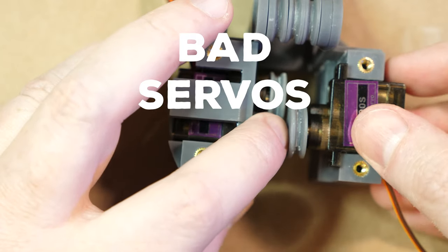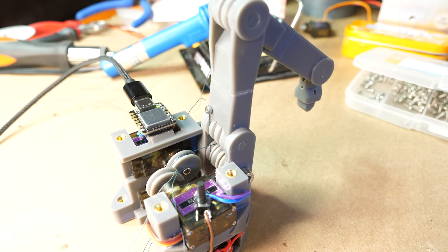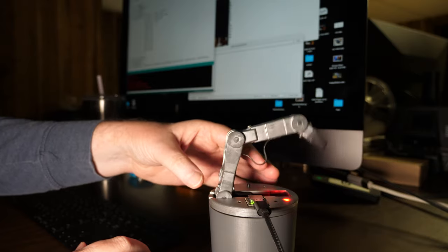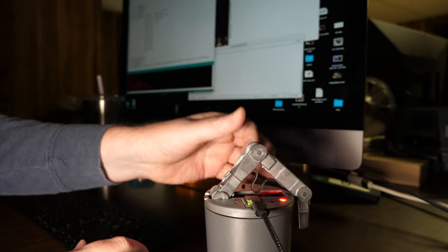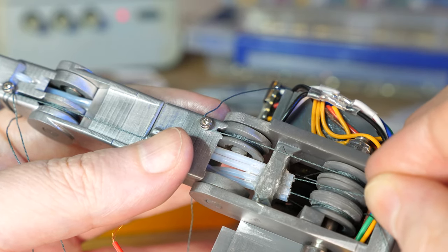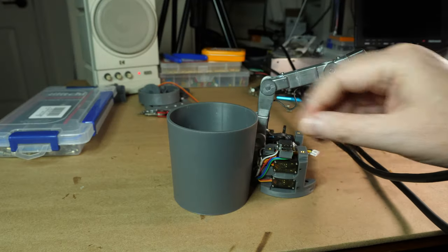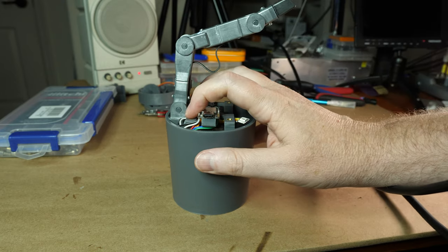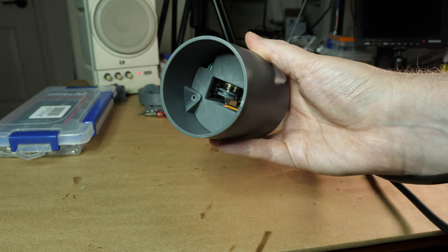So let's talk about some of the other issues there were with this design. The biggest issue was the servos — they were the bane of the project. They had limited motion and also weren't strong enough or accurate enough. It's why it took so long to get this video done. So the next time I make a robot, I'll be using much better actuators. I think using the fishing line as tendons also caused some problems. Some sort of geared or direct drive would probably be better. The other issue was that when I started the project, I mismeasured the cup holder, and my design only used about half of the available space I had in there. So if I were to do it again, I would fix that and it wouldn't be such a tight fit. I don't actually recommend that you try to build one of these — it's just a silly robot. But links to the code, parts, and 3D files for this project are in the description.